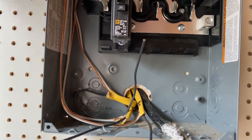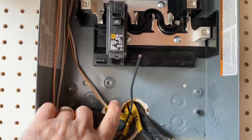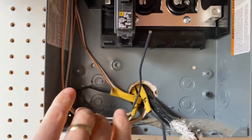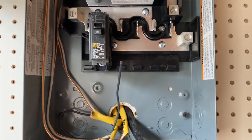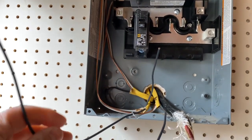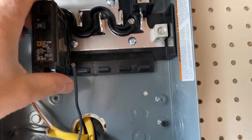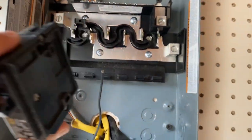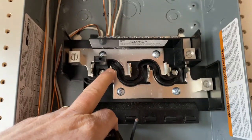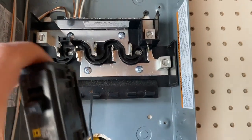I do have the AC here — I could wire it in and just leave the switch off so it's all neat in there. I really wish I'd left a little more wire for this one. I've got the label on the back side of it showing where it goes. I'll get these in, get all the wires cut down the sides neatly. To take these breakers out they just pop out — there's a little clip on the back that sits onto this thing and then it pushes onto the power bar.